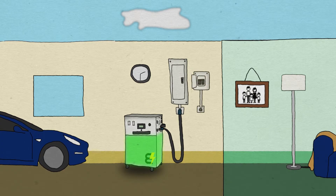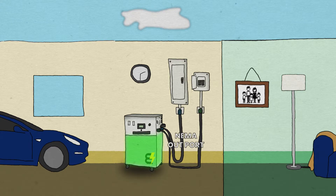Now, run another 50-amp extension cable from the NEMA out-port on your walrus into the generator port on your home's electric sub-panel. If you don't already have a sub-panel in your home, you'll need to have one installed.